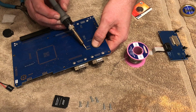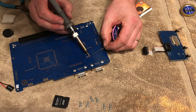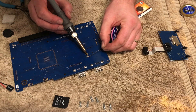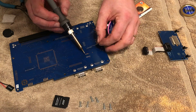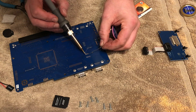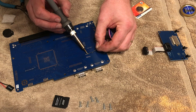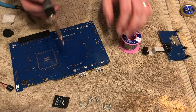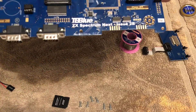I'm not sure sticky sellotape would work, but perhaps it would. So, we're going to solder these eight pins - it's nice and easy to do. There's good spacing between the solder pads, so there's no excuse really for making a mess of it. A little bit of solder splash there - just make sure you haven't bridged any of the pins. Get the solder nice and warm, don't stay on there too long, and it should be all good, nice and easy.